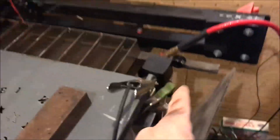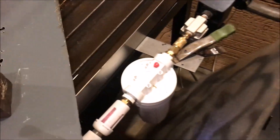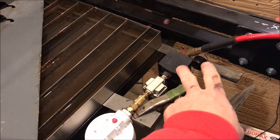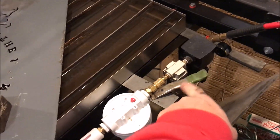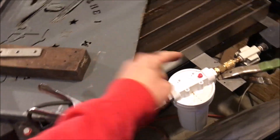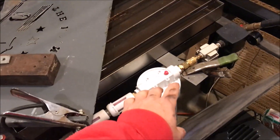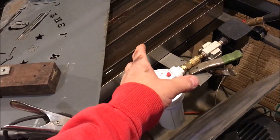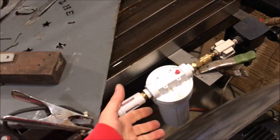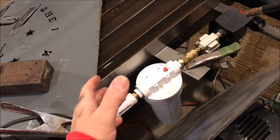Other issues I've come across — and these have nothing to do with JD's plasma cutting system — is air. Dry air is important when you're doing plasma cutting. I've added an air system that dries: I've got two water extractors and this larger one is actually a water purifier for your house. I added a tube in the center so that air comes in, has to go all the way to the bottom and then come back up, and the only way to get to the bottom is through a whole chamber of desiccant. I use unscented cat litter desiccant — there's a lot of it in there. I can unscrew it, pour them into an aluminum pan, throw them in an oven and dry them back out, then reuse them.